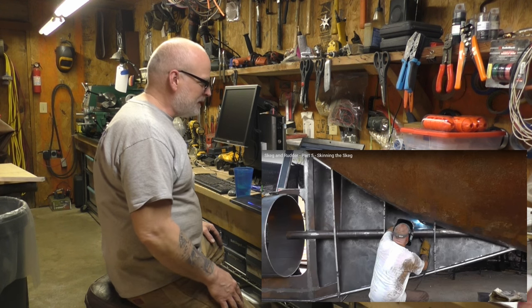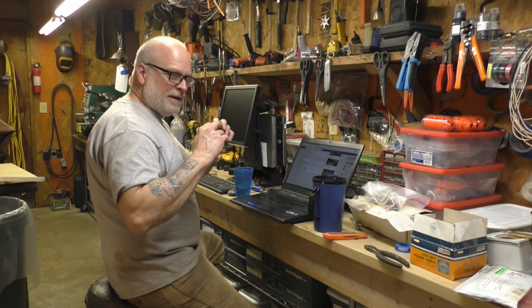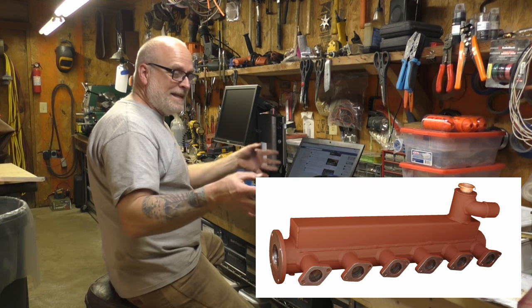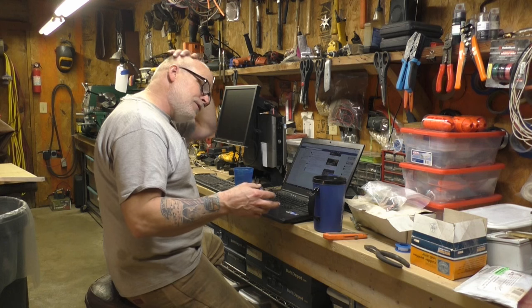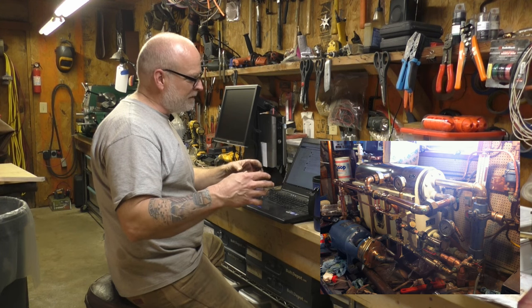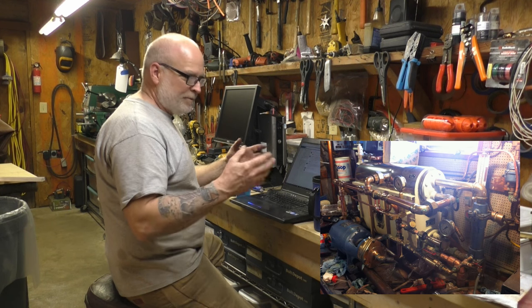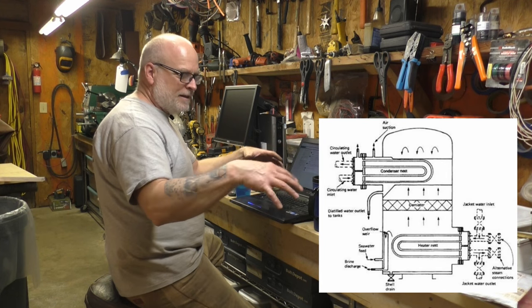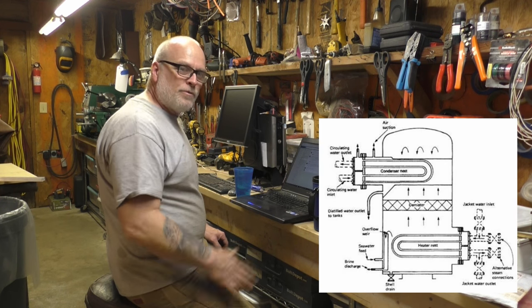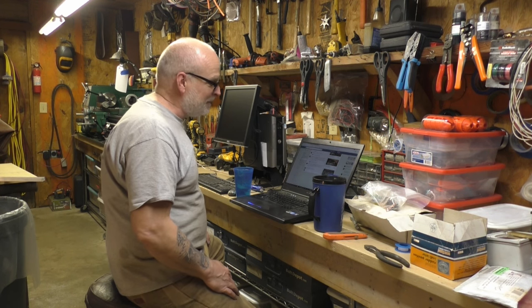We've got this huge skeg which will have around 150 gallons of fluid in it with vast square feet of steel against the water. We're talking about cooling the exhaust — they often put in an exhaust cooler, and for our six-cylinder diesel it's not that expensive. Then we can take that hot water and use it to work a distiller instead of a reverse osmosis machine, which requires lots of moving parts. I like the distiller idea because it's something I can fix in Fiji — no parts needed. You just heat the water, boil it off, pull a vacuum, condense it down, drain off your fresh water. We can probably work it off low-volume pumps and solar energy, and when the engine fires up we can make a lot of water if necessary.